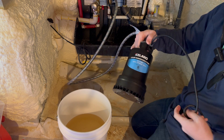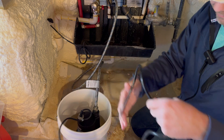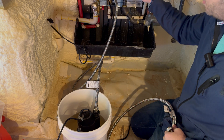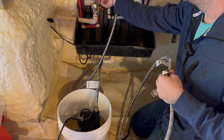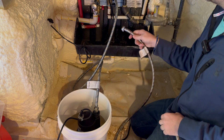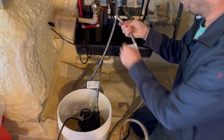Then you can place your pump inside of the bucket. As the water is pumped up from the bucket into the water heater, it'll run through the system and come back out of the hot water side. So you'll connect the red braided hose to the red service valve of the isolation port, and that will just go back into the bucket to return the water.